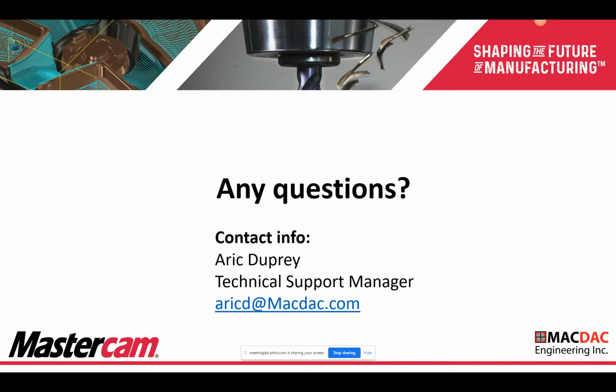Okay. All right. I got a couple things I need to try out on that multi-axis because I had a couple weird things happen in the Rotary, and I think one of the things you showed me hopefully will fix that. So I got around it, but it was a challenge. Just make sure you have stock set up, or else that toolpath doesn't do very good. I'm sorry, repeat that again? Make sure you have stock set up for the Rotary Advanced, or else that toolpath isn't going to really work good for you.